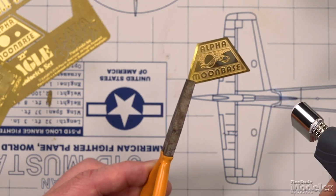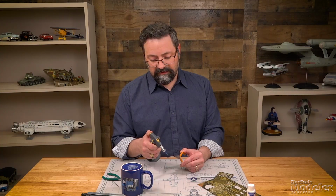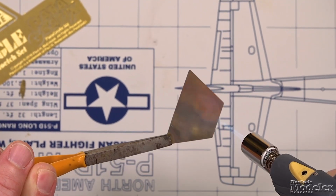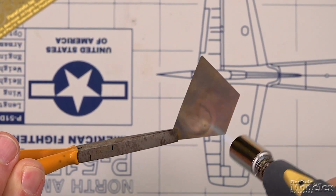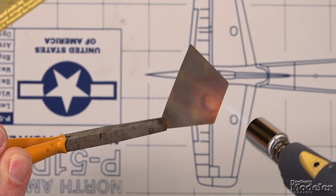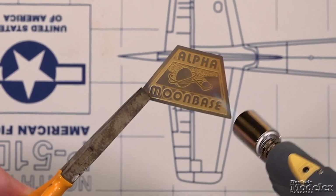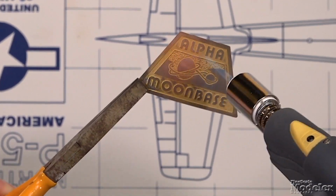remember, you want even heating. And I'm just going to flip this over real quick, so you can start seeing that color change. I'm going to flip this over so that you can see it from this side. You can definitely see that there's that color change, right? Now, if this thing starts to glow red, you've definitely gotten it annealed well enough. You can see that it's starting in some of those spots. You can definitely see that it's starting to turn red around the edge there, right down through. All right, I'm going to turn this over. Yeah, there, you just see that hint of red.